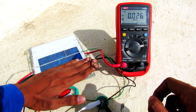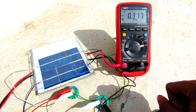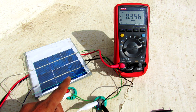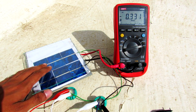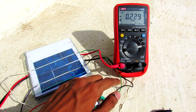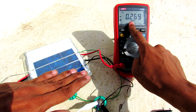Previously without the capacitor we were getting just 10 milliamps when covered. After letting it charge for some time it recovers back to 320 and settles at 360 milliamps. Now let's simulate a bird flying over — as you can see, the current is not dropping instantaneously the way it did in the previous method where we had just the panels in series without capacitors. With a shadow over the panels the current does not drop instantaneously.